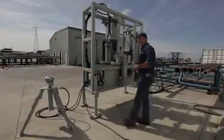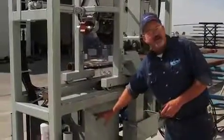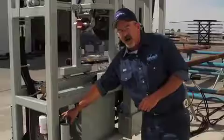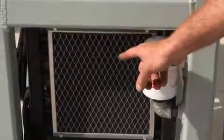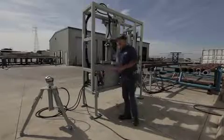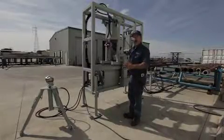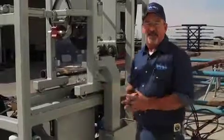Continuing right on around the machine, you can see right here in the center of the machine we have a 35 gallon hydraulic tank. We have a hydraulically motor driven fan assembly with a radiator cooler up here on the front. The entire machine is powered by hydraulics. We've been able to seal up the hydraulics and tighten up on this heater right here where grindings and things of that nature will not affect this machine in any way.